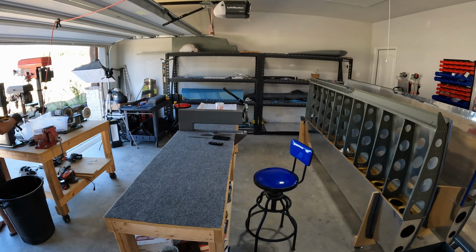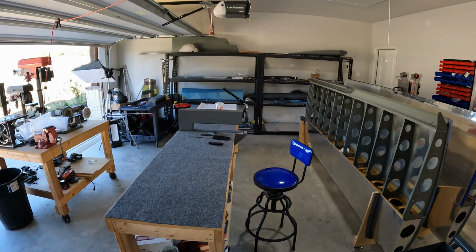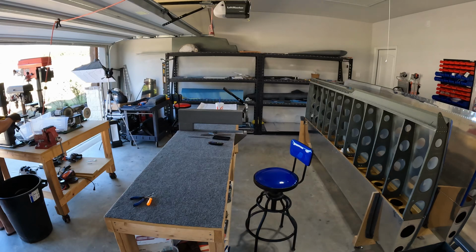As you all know, it's been a long time since I've done any building, and so once I finished all of this trimming, cutting, cleaning the edges and shaping these stiffeners, then I got a nice little tub of soapy water and started washing them and put on latex gloves, and then realized that that's really unnecessary for what I'm doing with this rattle can primer. That was a habit that I had created when I was working on the tanks. That's a different story because any oils from your skin can cause that Pro Seal to not get a good bond with the surface. So I went ahead and finished doing it that way today because they were already in the soapy water. But it's an old habit from the month that I spent building the tanks.